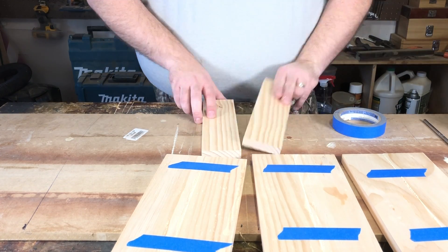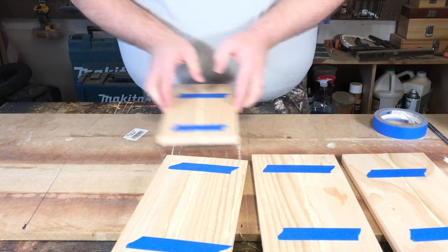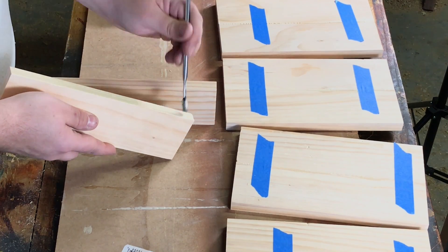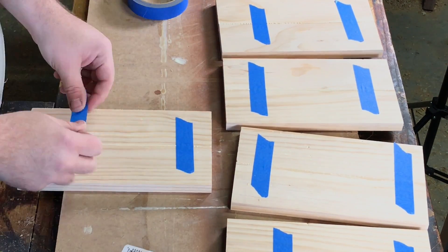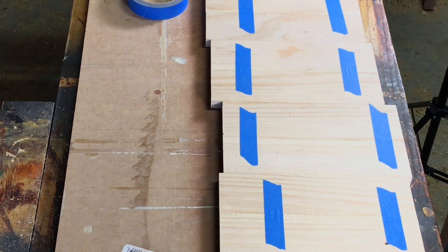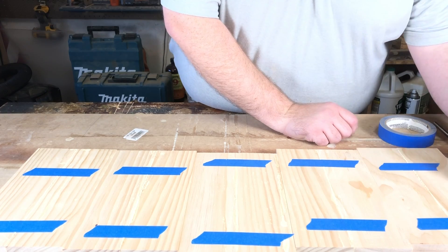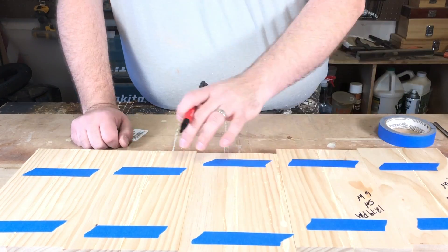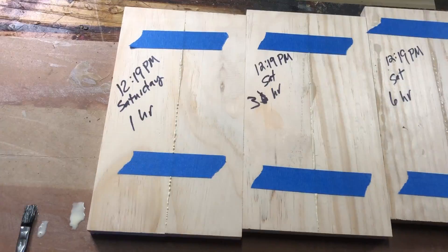You have to apply the tape to both sides because after you put the tape down and stick it down, the tension on the tape will actually pull that joint together more on one side than the other. So similar to using clamps on both sides, if you're going to use this taping method, you have to put tape on both sides, otherwise it's not going to work. And you can actually see the wood pull apart on that opposite side once you've got the tape down on the first side.